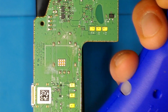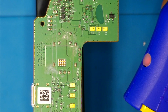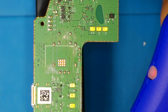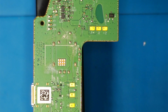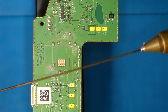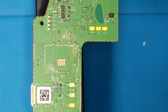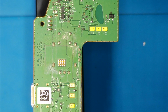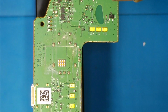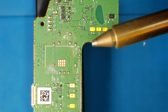So let's turn this thing on. Hakko products are pretty good, it doesn't take too long to heat up. Sometimes I like to clean it first. You know what? It might be okay. Anyway, let's just try it out. The solder is MG Chemicals 6337, 2.2% flux, 22 gauge. And I found this to be the best solder, at least for this application.